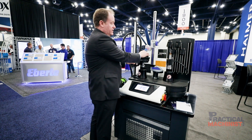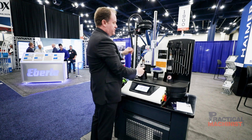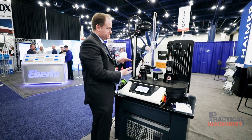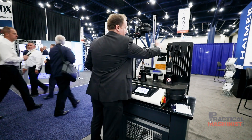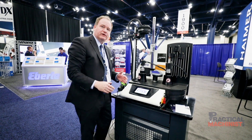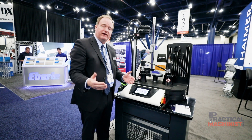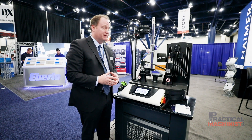In this case, I'm setting the tool, I heat it up, and then I bring it in and it springs up to the stop. So now what this has done is set this tool exactly to 200 millimeters. I'll go ahead and get it out of the way since it's starting to grab. When I cool it down, that will be exactly at 200 millimeters. The next chain of events would be to bring it to the pre-setter I showed earlier to get your final z-axis and x-dimension, and then bring it to the balancer to confirm that it's still balanced as an assembly.